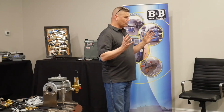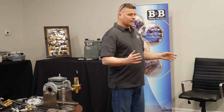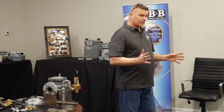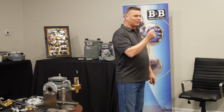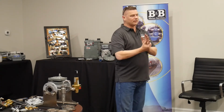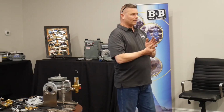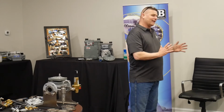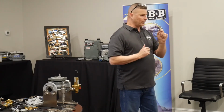We've got to talk to the customers every time we're doing this about, again, application. What's your system look like? So we can help them with that. What would be the obvious solution if they say, yeah, I have a relief and I don't want to increase capacity here? What can I do? Reduce the throttle plate size and the conversion one size. If I was at 100 with an FG3 and I give them a conversion kit that has a 75% plate, what's the new CG? Exactly the same? It's not, they're both 1130. It's not exactly the same in every step down, but it's really close.